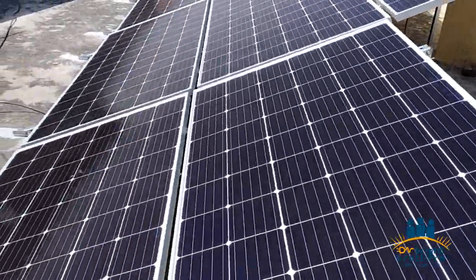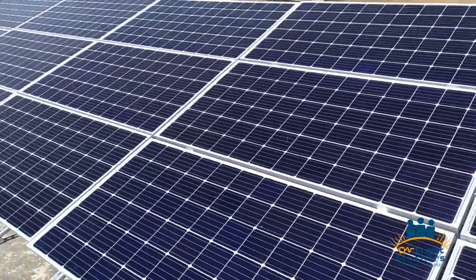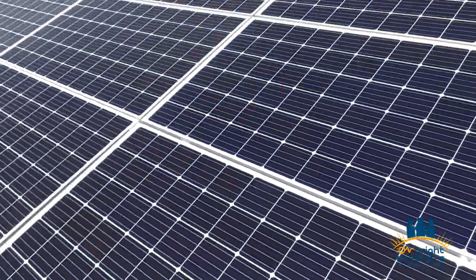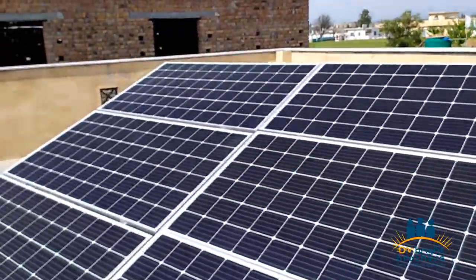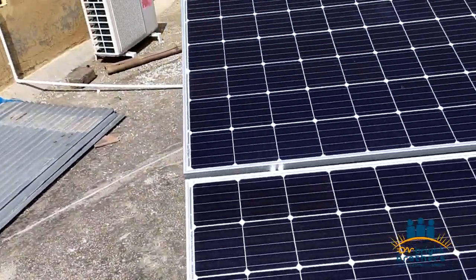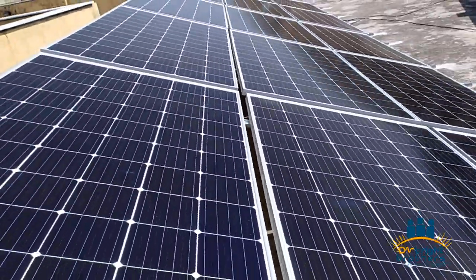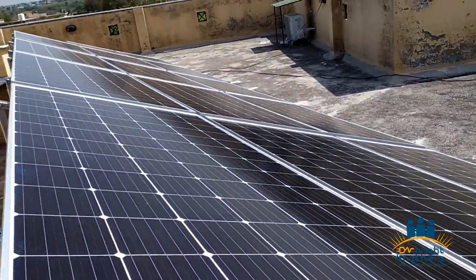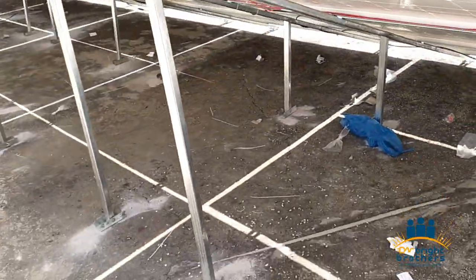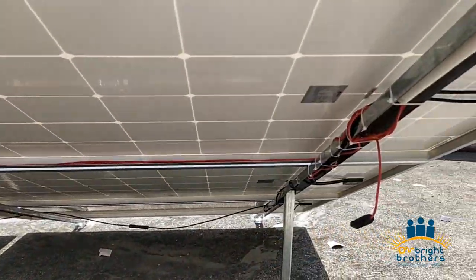Again, you can see the panel's quality, and you can have an idea about the quality of these cells. As you know, mono has better efficiency in weak light, and it can perform a better yield as compared to polycrystalline. Even for temperature, before we were told that mono did not have better resistance as compared to poly. Well, that has changed now. With PERC technology, they have improved the temperature coefficient very much.